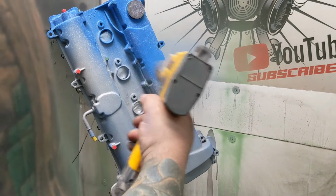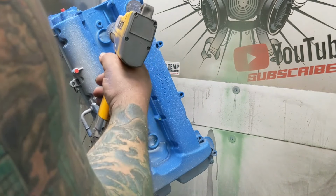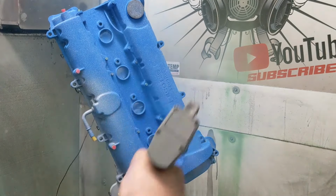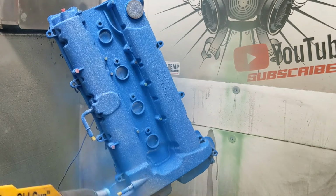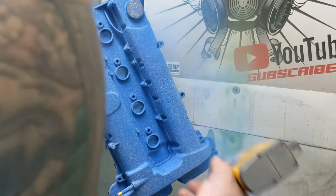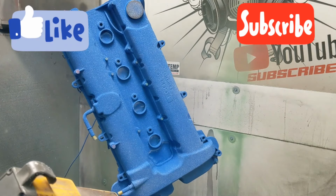So throwing the Illusion Light Blue base down on this. I'll turn the kV down a little bit. I decided I was going to go in here first, since I was fixing the ground real quick on that one. Illusion Light Blue, of course, is a super nice powder. Like most of the Illusion colors, it lays perfect basically every time. That's never given me a hassle.